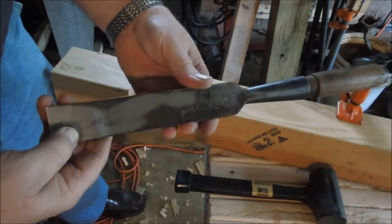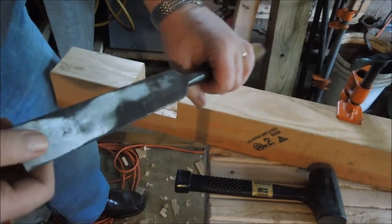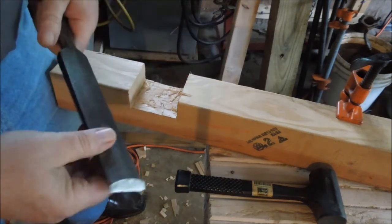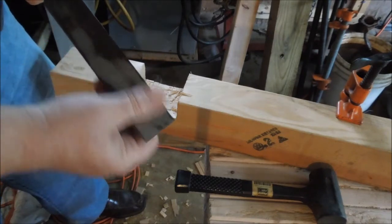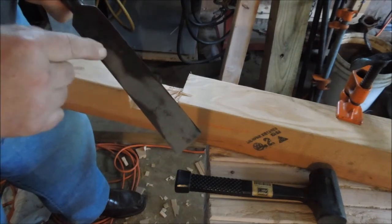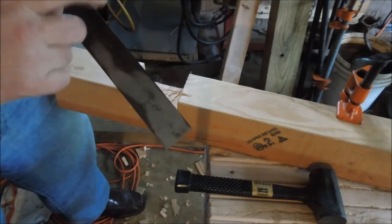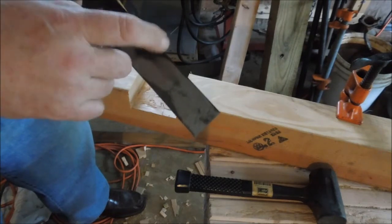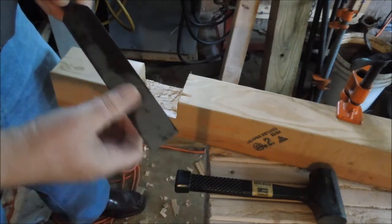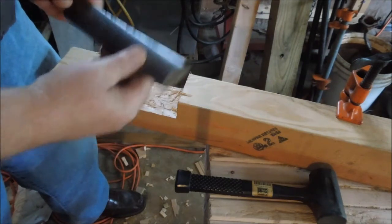This is a great chisel. It's a Witherby. I don't know if that name means anything to you, but a guy named Witherby made chisels. And when he made them, he laminated a piece of hard steel into the back. You can see the line between the soft steel and the hard steel right there. Hard steel, soft steel. Makes a difference in the sound, doesn't it? Also, this hard steel polishes right up and holds an edge. Still razor sharp, and I sharpened that 2 years ago.